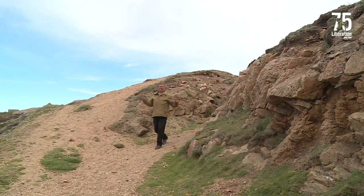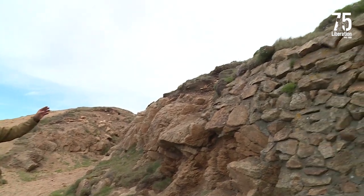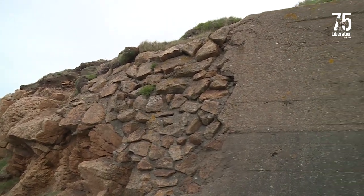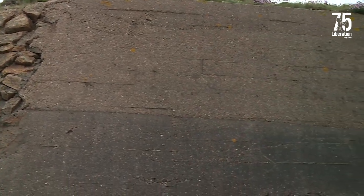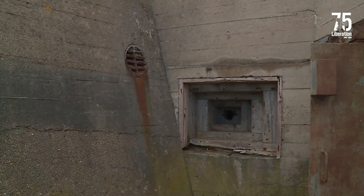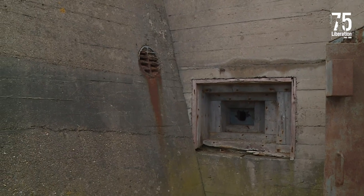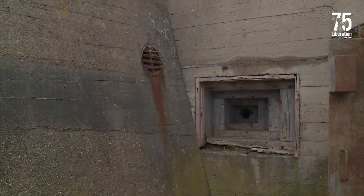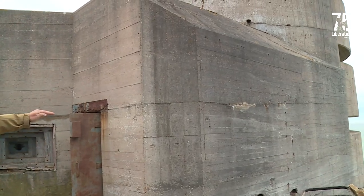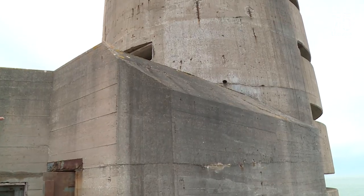This whole area was covered with camouflage netting. When you look around you can see where the Germans made big use of the natural camouflage by utilizing the original granite which they carved out of the area. To your right you see the cast of the concrete for the tower, and a little bit further along you'll see the intake for the ventilation system which was for a gas lock slightly inside the tower. Just to the bottom of there is an entrance defense for a heavy machine gun which would have defended the entrance from any commando attack from the cliffs. Here just to your right of the entrance defense you can see the different stages of the concrete pour for the construction of the tower — that line at the bottom is the first day's work, then a second, a third, and so on as you go up the tower.